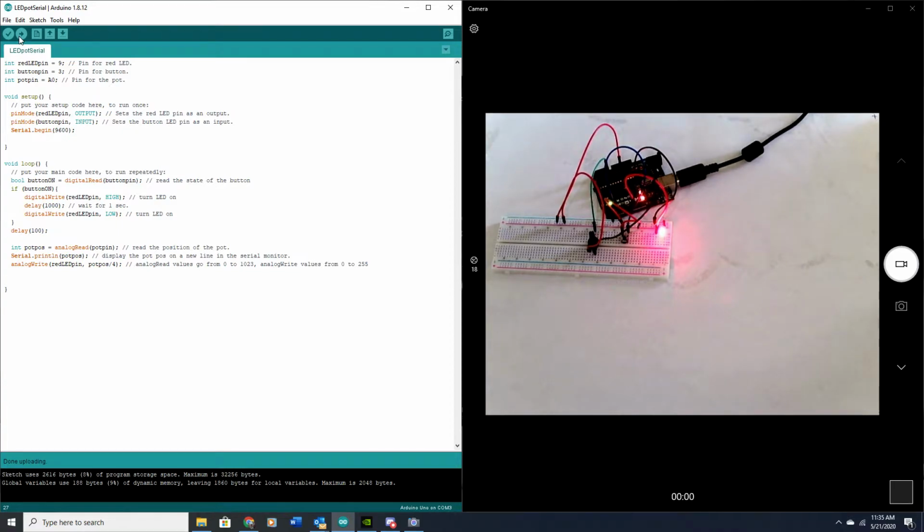So that's basically all the functions you need to be able to control basic mechanical systems or electromechanical systems. We have analog input, analog output, our digital write, our digital read. We have analog read and analog write. We've discussed some of the limitations and the functions that we're using in terms of the rates and the methods that are being used to actually accomplish those tasks.